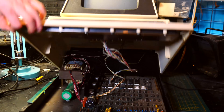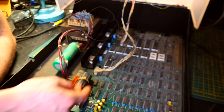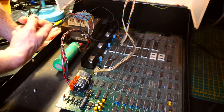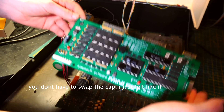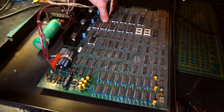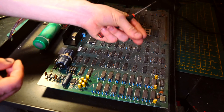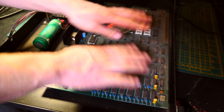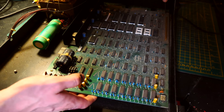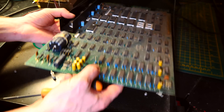That one is built and working. We're going to look at it a little bit later, but first I want to look at the next one. This one is purpose-built to actually replace motherboards within the Commodore PETs. This 3032 is in desperate need of a little bit of love and attention, and I think this will be the perfect one to make permanent as PetSynth. When I turn this on literally nothing happens — there's just a little blip to show that the monitor is working but it's receiving nothing from the board. We're not going to look at fixing that problem; we're literally just going to swap the motherboard. How often can you literally just swap the motherboard in an old computer with a brand new one? That's just madness! Out it comes!